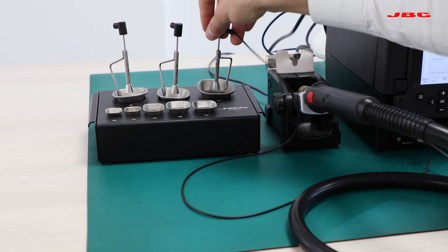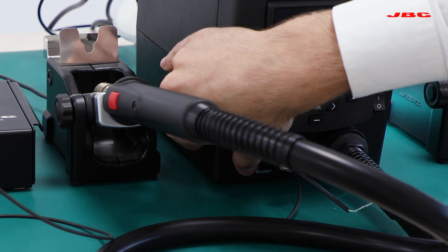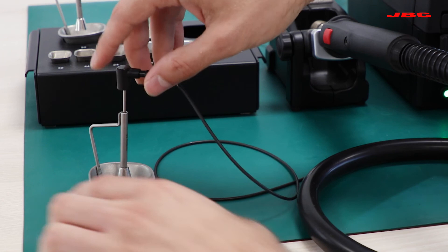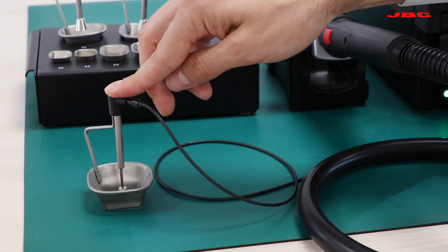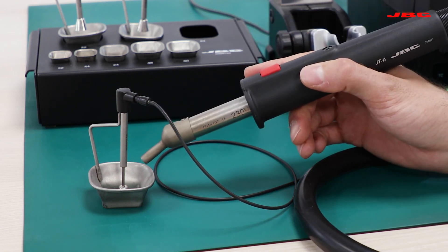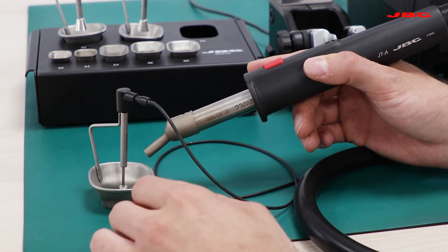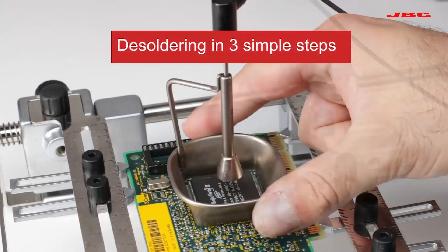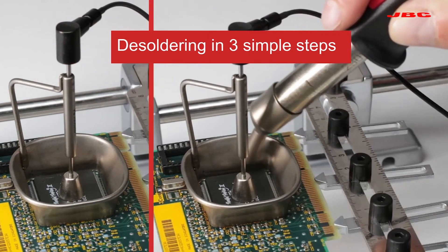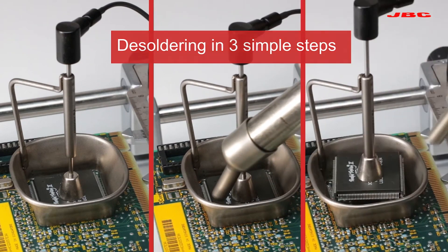The system also comes with an extractor suction system as mentioned. You can turn on the electric pump to create suction — the system has a suction cap that sticks to the component and is spring-loaded. The main idea is that you start working on the component and leave it in a fixed position, as the air will circulate around the shield protecting adjacent components and focusing heat on the specific component being reworked. As soon as it reflows the solder, it will automatically pop up the component.